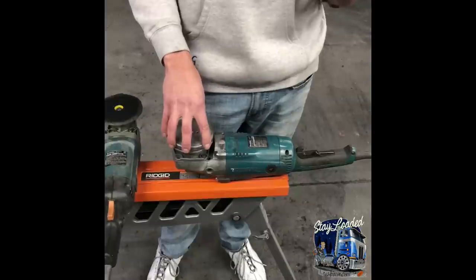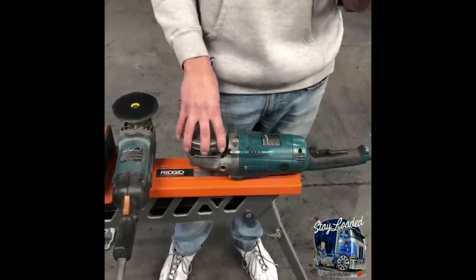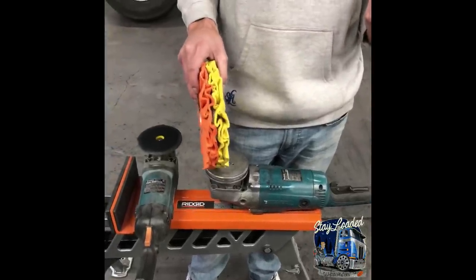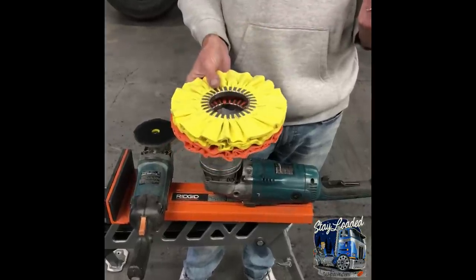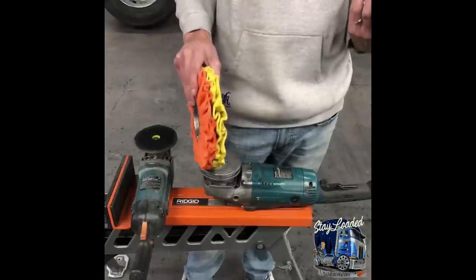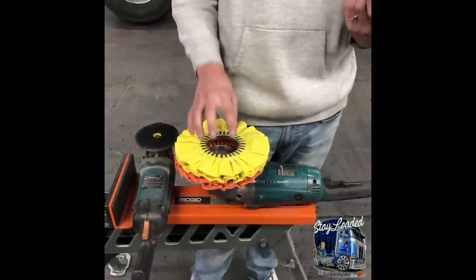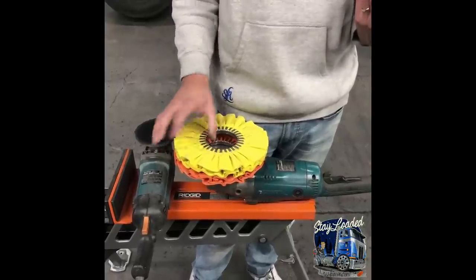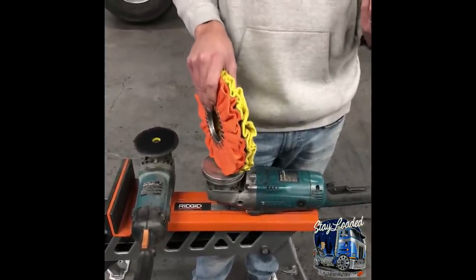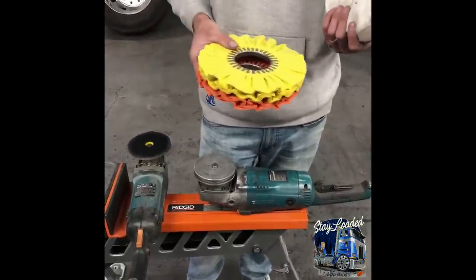That wasn't my own personal fault — we've had some buffs blow out when we hit them on glad hands and it likes to cut along the trim ring, but we haven't personally had any blow out that's hurt anybody. On the high-speed buffer, the only thing we run is our cutting pads or coloring pads — orange, yellow, red, pink — any heavy airway with heavier fabric, we'll use on the 6,000 RPM. The softer fabrics at 6,000 RPM don't hold into the clinch rings; at higher speeds it tears the fabric apart. With softer fabrics, your likelihood of blowing out is very high.